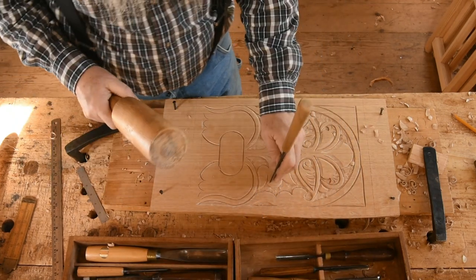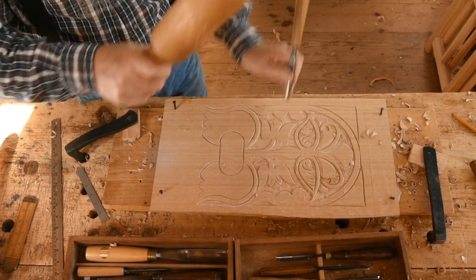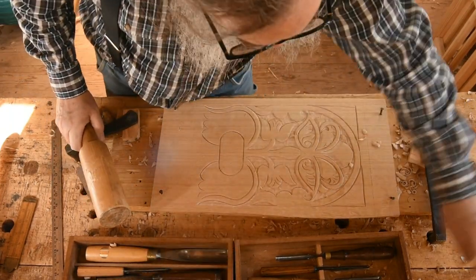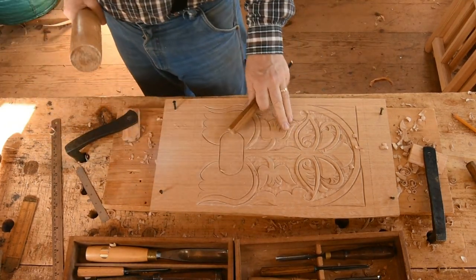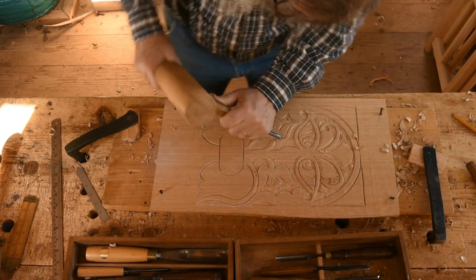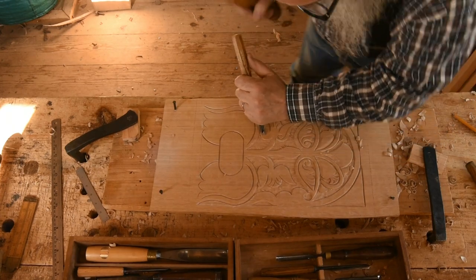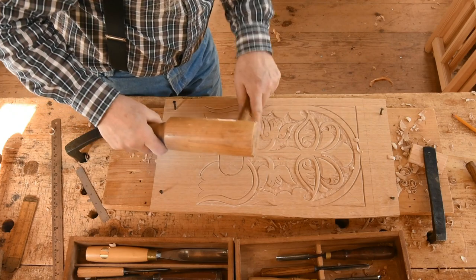Similar stuff in these leaves — I've got a little scroll in those as well in this piece. And this is pretty tight. You hear how I'm just tapping now, not really driving hard with that v-tool, so it comes along, following there. Just keep pivoting the tool and then stop, like that.